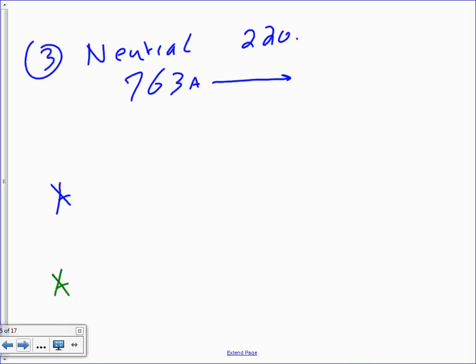The code says there's the rating factor, I don't know if you guys remember, 220.61(B)(2). If you go to 220.61(B)(2), it tells you anything higher than 200 amp, you can cut it by 70%. You guys remember that rule? On the neutral, any amp higher than 200 amp, you can cut it by 70%. Okay, so let's apply this rule.